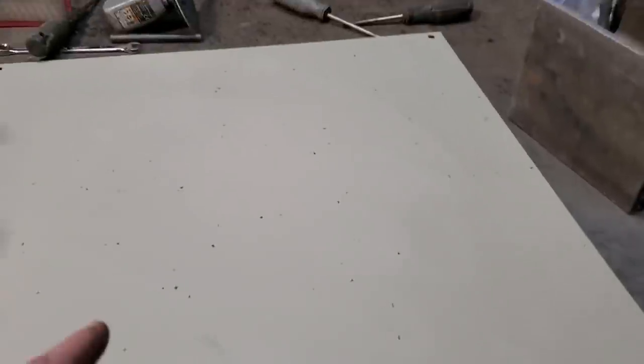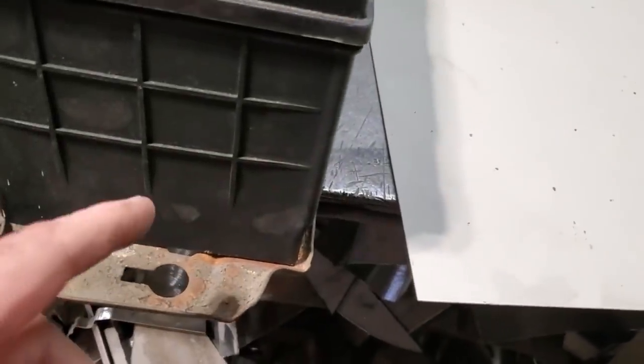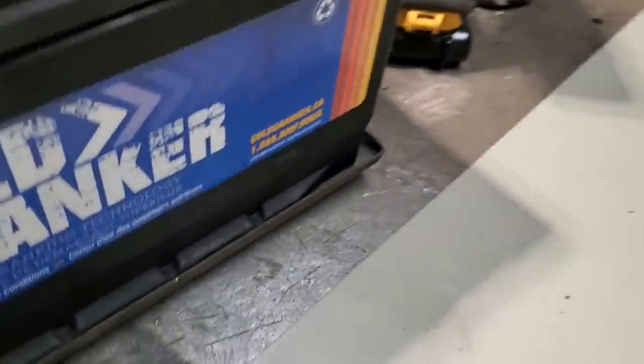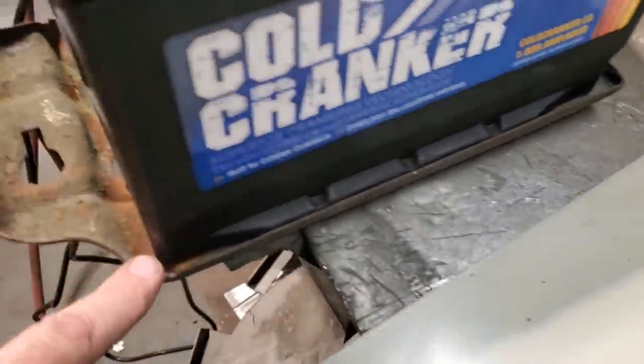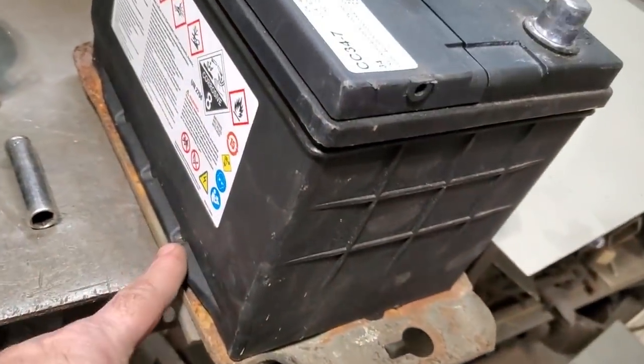Okay, first thing I did, I got a piece of old locker door, a bit of recycled metal. I'm going to use that. It's pretty heavy gauge, it's 18 gauge, so that should be plenty heavy enough for this. I went and turned around at just the battery that's going in it. So I laid it in the old Mustang one just to give an idea on how it fits, so I can probably use this to go by, which I'm probably going to use.